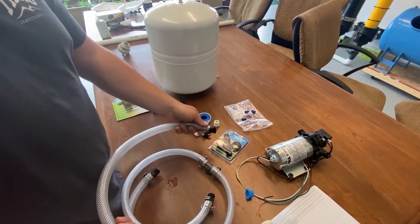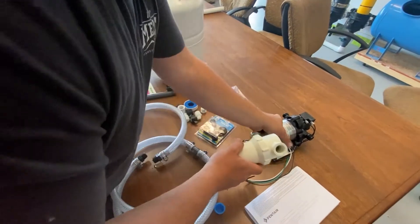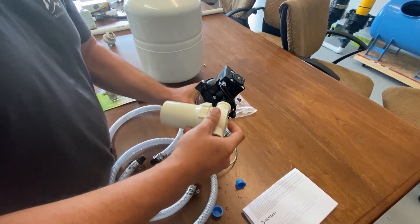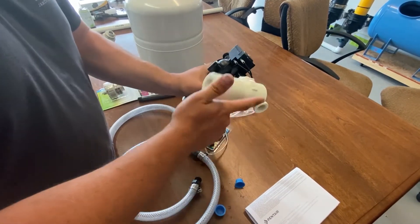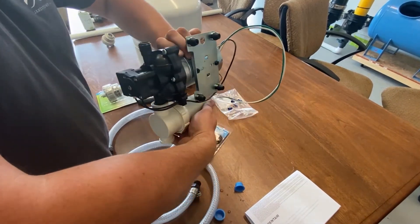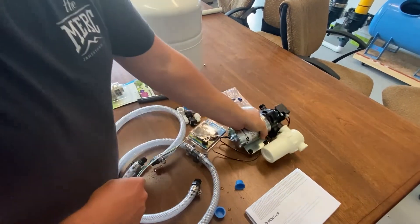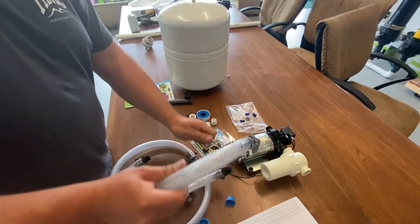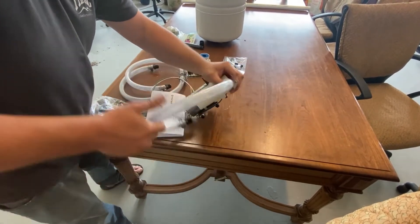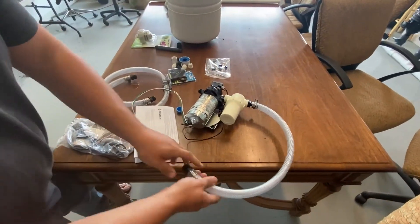Connected to this bulkhead fitting, you can use a bunch of different fittings, but in general you're able to screw this directly into that bulkhead fitting. From there, this tube will connect to the filter, and your filter is going to connect to the pump. You don't want to over-tighten these — everything's plastic, so just do hand-tight, because if you over-tighten it something is going to crack.